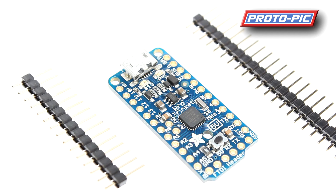You have 2k of RAM, most of which is available to you. It runs at 16 MHz, the same as an Arduino Uno. The key difference is that even though there is a USB connection on there, you can't use it for serial communications — the inbuilt bootloader uses pins 2 and 7, which are also hooked up to the USB connection to provide a programming interface. It will show itself as a USB Tiny programmer when you press the reset button. The onboard regulator is limited to 150 milliamps, so you'd use it more as a controller with an external power source.